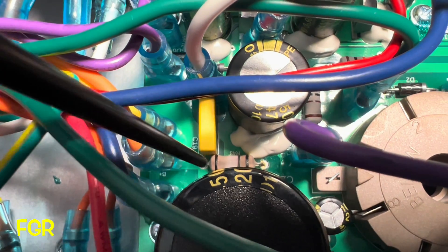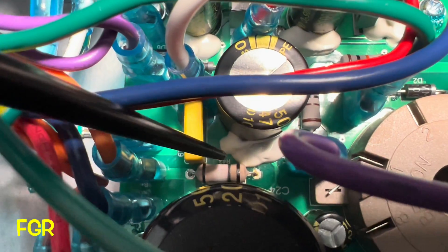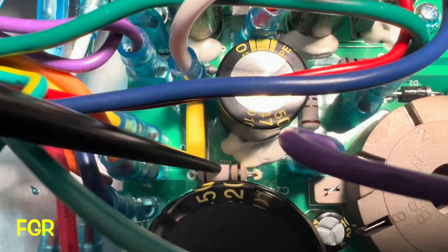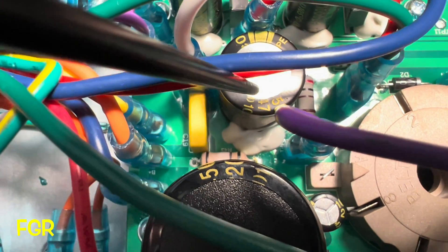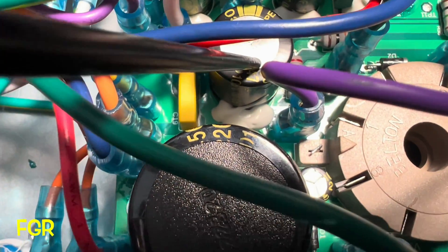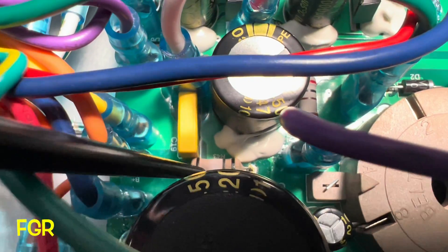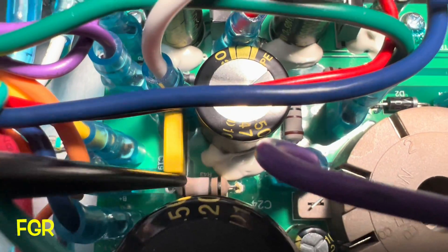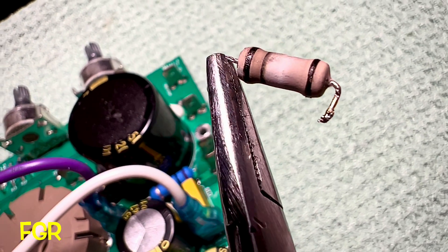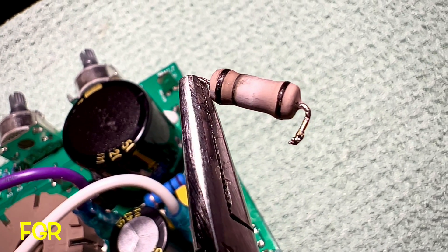Now that's this guy disrupting the flow of voltage to the amp on that standby switch — that jumps across this dude right here, who looks partially vaporized. And then no doubt this is the node itself. Hopefully this cap hasn't shorted and pulled excess current through this resistor, but it doesn't look like it. This is the roasted screen grid resistor on your Supro Delta King 10.